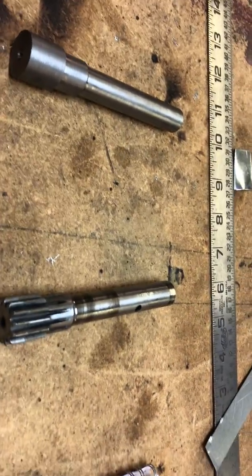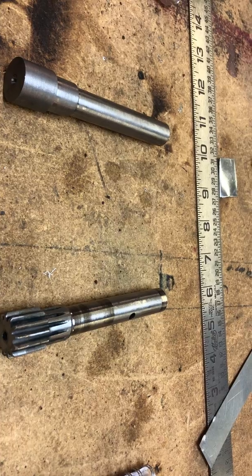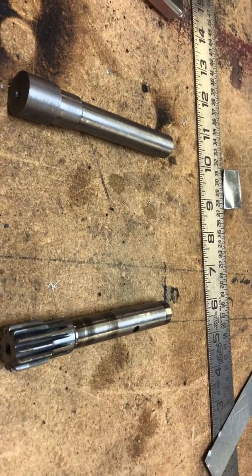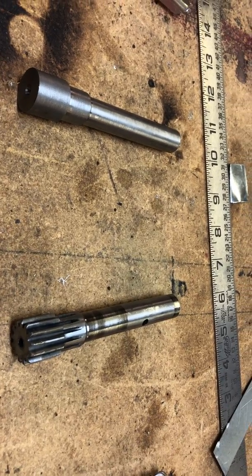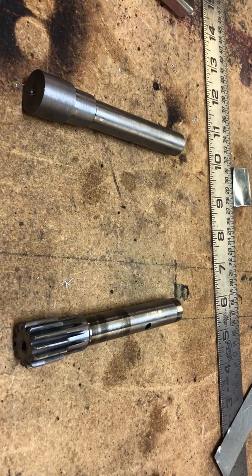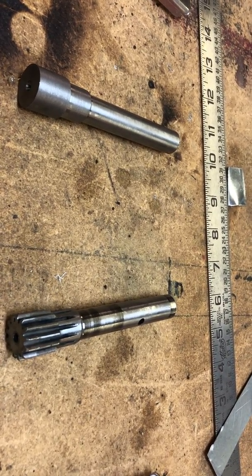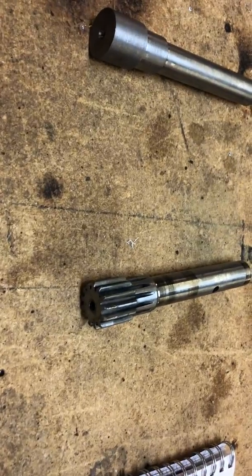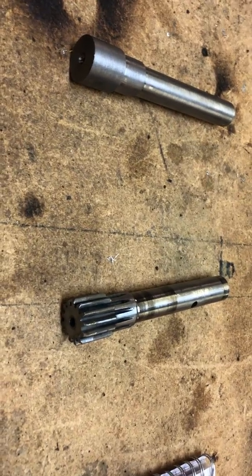What happened was I got the thread pretty much cut. I threaded the right distance and the right depth, everything, measured over wires. The thread was coming out good, and I had a small hex section for threading it into the breech of the gun. It's an Austin Halleck muzzle loader, and they use a metric thread on the breech plug.